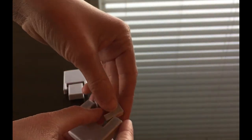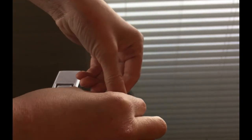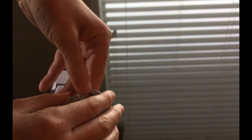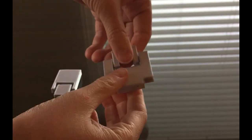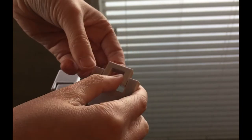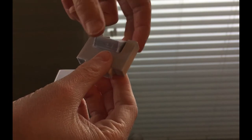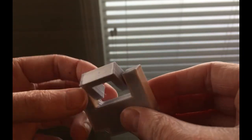So one other thing I wanted to mention with this other hinge that I designed is that when you see this one, you can see that it is on the verge of being able to snap together or not, and I actually had to push quite hard, harder than I would have liked to, so I would recommend taking that into account and maybe shrinking it a little bit more and only going to the size that you plan on needing. So you might need some calipers or something to measure it. But when I snapped it in, you could see that it works very well, which is the really good thing about this hinge compared to the other hinge, is the other hinge doesn't spin as well, or as freely.